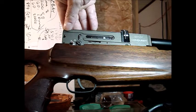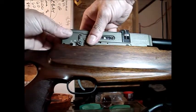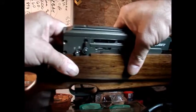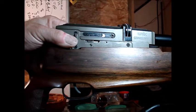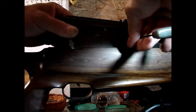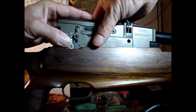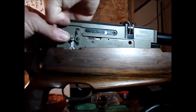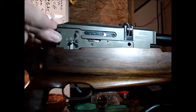I'm going to gently pop this apart just about one millimeter. You don't want to take the two pieces completely apart because the insides of the gun will pop out and you won't be able to get them back together. It looks like I missed a couple screws right here — so make sure you get all of them. Keep your hand on it when you remove the last screw so it doesn't fly apart. Now gently — it's coming apart.